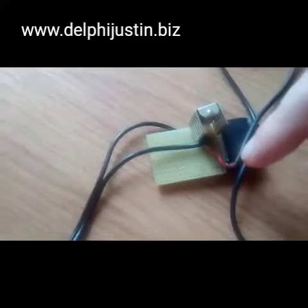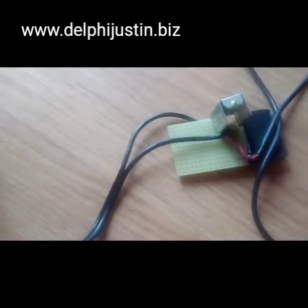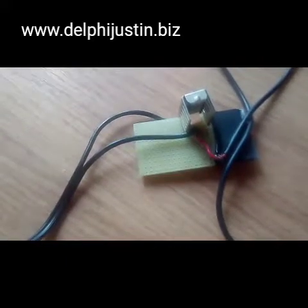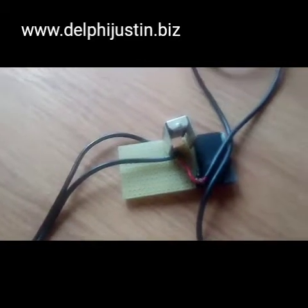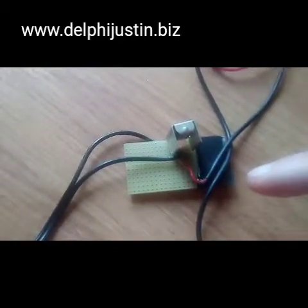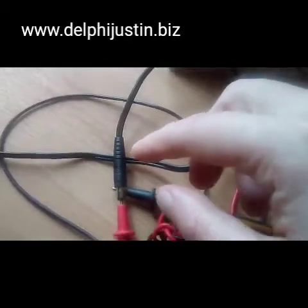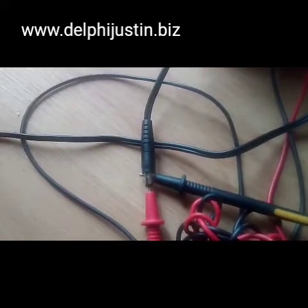And yeah, there are two different types of cord on here because John wanted to make the cord longer. So what we did is we took an audio video cord for a TV and used it to transfer power to it. We cut the ends off. This had a yellow end on it, and we cut it off and soldered it onto the board there. And that transfers the output power into this cord here, and it goes into the DVD player. It allows you to charge the battery or play the DVD on it.